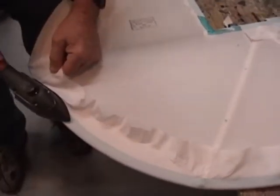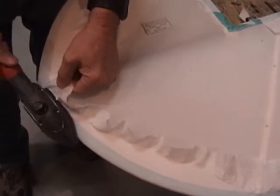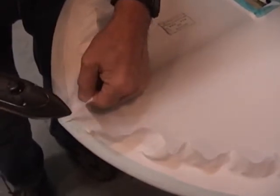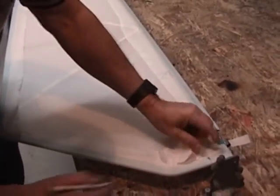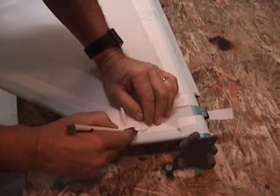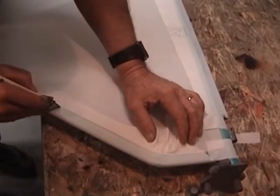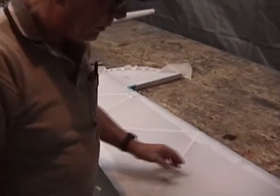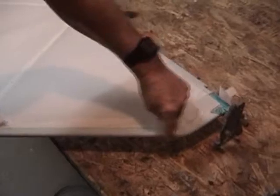This is a pretty tight little area right here. What you don't want to do is pull and stretch that fabric real tight — just let the iron do the bulk of the work here for you. Now what makes this really work is that we made a pencil mark and put a glue line. We're going to put a trim line now, which is right at the edge of that original glue line, and right there is where this fabric will trim off. We've finished marking around the perimeter. The next step is where we pre-iron this real tight. Then we pull all of this nice pretty tape loose — the nice part is it stops right here where we nail it down with the heat.